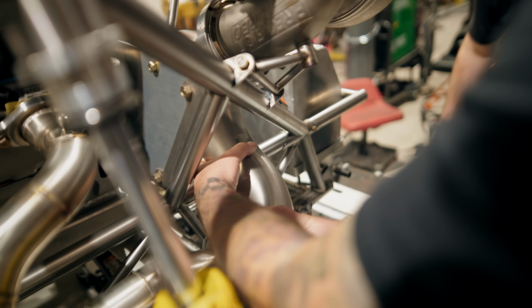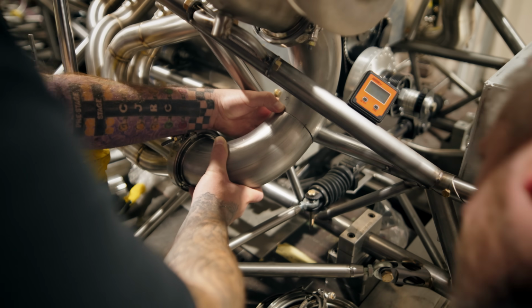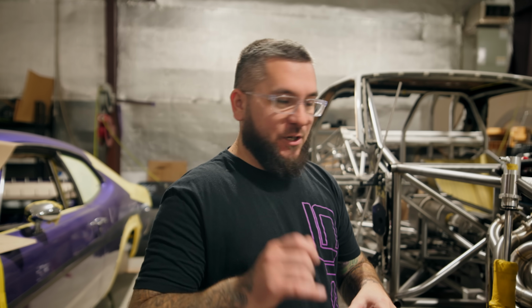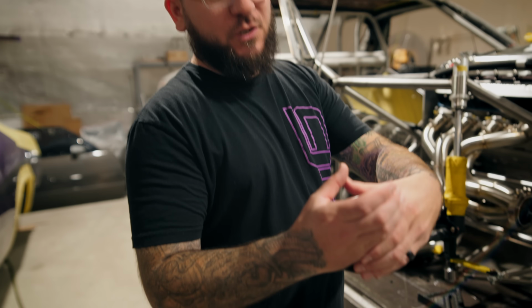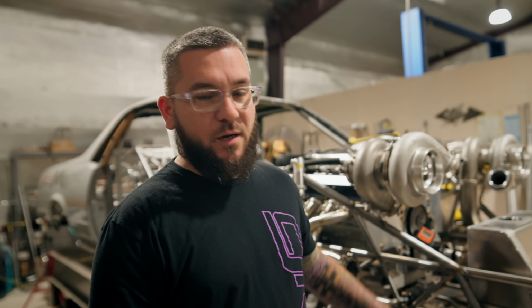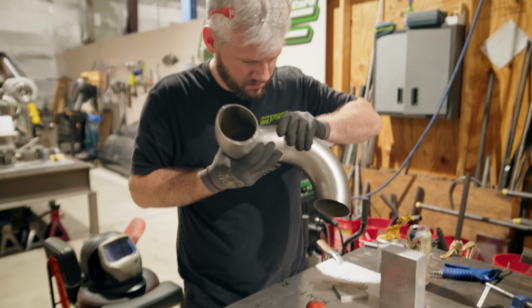You just, like you said, find the happy medium, because you tack it and then these tubes, wherever they're bent and you cut them in the bend, they end up oval instead of round. We try to straighten them the best we can, but it's really hard to get them perfectly straight. So if they're oval and you turn them this way, they end up hanging off the sides a little bit. You got to straighten them and get them really close. But then when you put lines on them, you got to make sure you don't line one side up and not the other side, and tack it together, and you end up with a big mess up here. That's what we were trying to do, is just make sure it was in the middle, so a teeny tiny bit was on this side and a teeny tiny bit was on that side, and not vice versa.